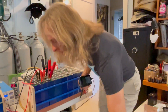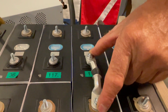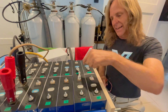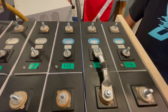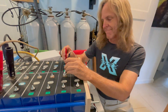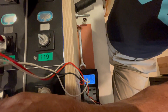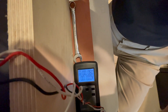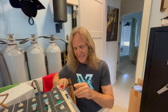Over here I've made a jumper out of one-aught wire — the same wire I'm using for most of the battery build on this system. I just put one together and it's not bent; it doesn't have a lot of flexibility, so it was critical to get it just right for the distance. When I measure on top of it — it's jumping around a little bit — I get about 0.06 to 0.07 milliohms. That's pretty similar to a copper bus bar.